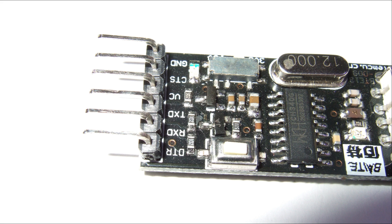Unfortunately I discovered that none of my USB-to-serial adapters have an RTS pin. According to the programming instructions, the RTS pin has to be connected to the reset pin of the ESP modules. Back to the drawing board again.